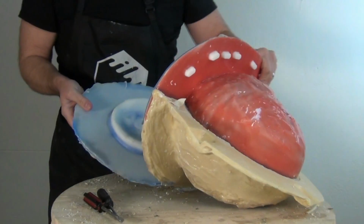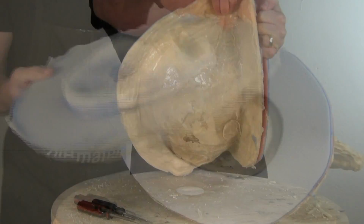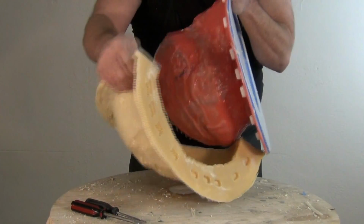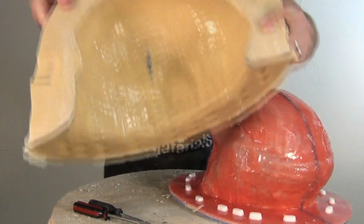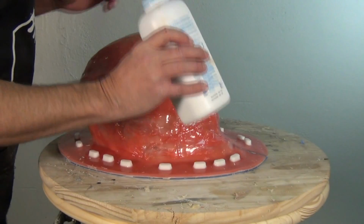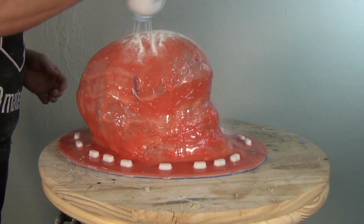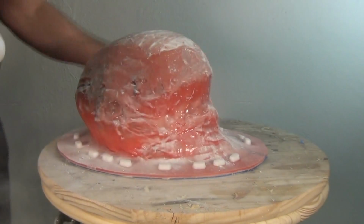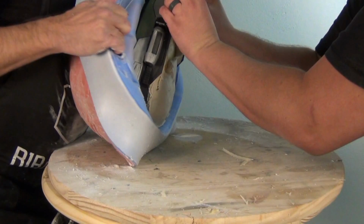Real important at this stage to not get impatient. Make sure you take your time demolding and trimming each piece of the mold. And now we have our finished silicone mold with BR75D mother mold. And of course we have our seamless mold there that we need to peel off our pattern. But we have our 3-piece shell that goes over the top and that cap that fits on the bottom. Now, because this does need to turn inside out, I'm going to powder this with baby powder before I start removing it. And that just helps that silicone move a lot easier over itself.